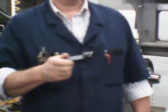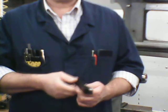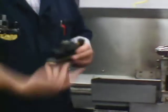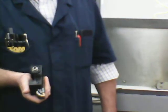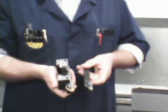Okay, what type of cutter is this? Regular carbide. How do you know it's carbide? Because it is mounted in with a clamp and it's silver. Okay. What type of cutter is it? Well, the cutter you would hold towards you. So if I was you, I'd hold it like this, or in this case, hold this towards me like that or towards you. Whichever hand it points to tells you the hand of cutter that it is. So these are both right-handed turning tools.